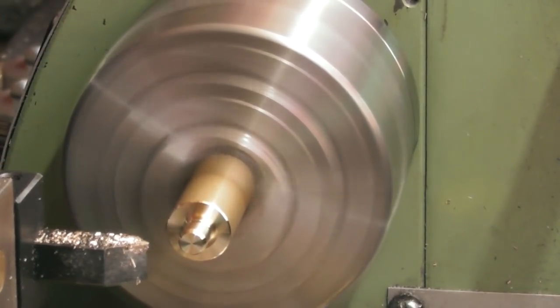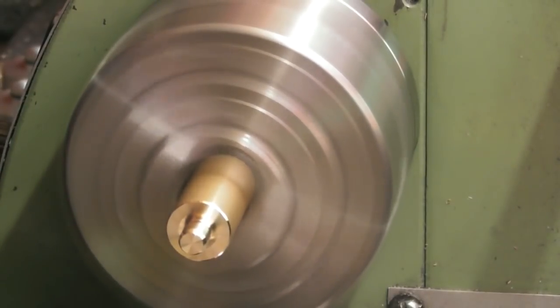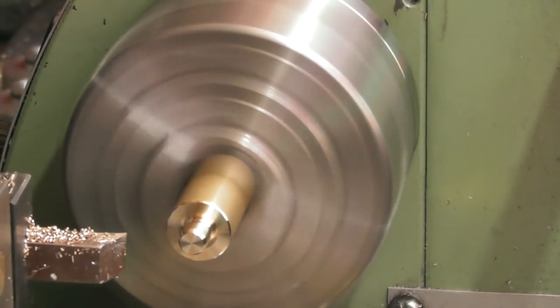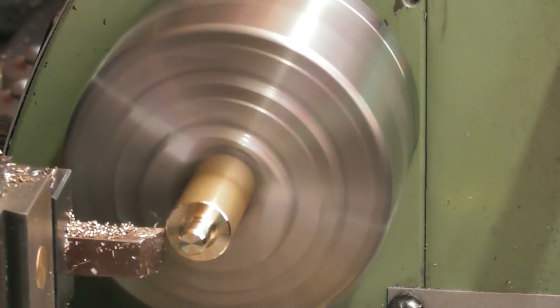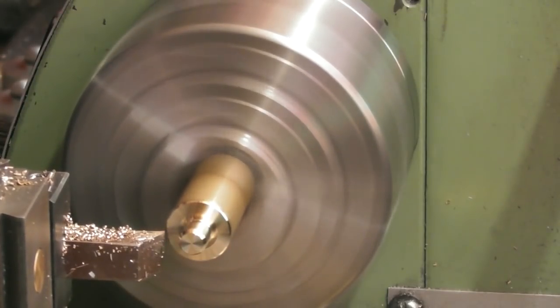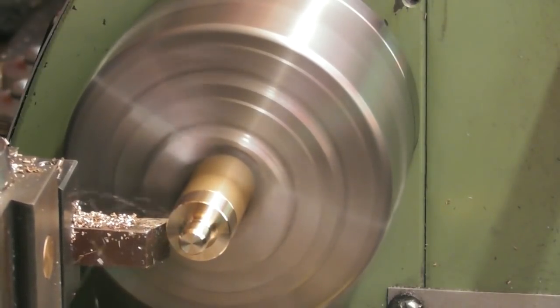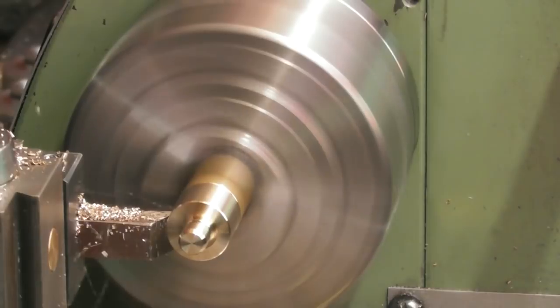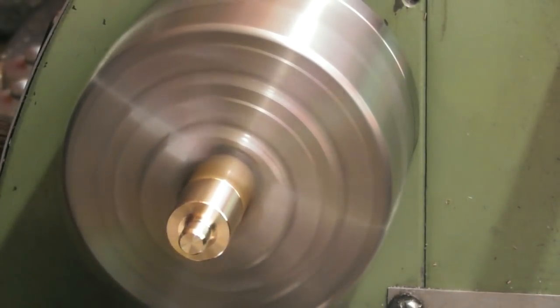While I'm at it, I think I'll machine the OD all in one hit. I think I took 0.15 off the other one from touch. There's touch. 0.1 aside. I'll use a feed for this. It's going to be 15mm wide, so I'm just skimming the OD, skimming it with 20mm back, no worries with that. And that's that done.